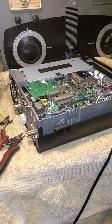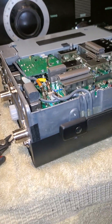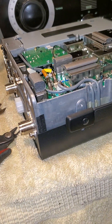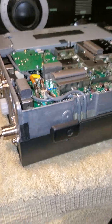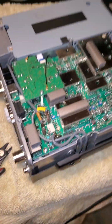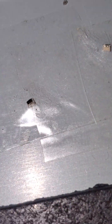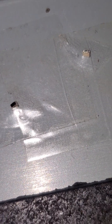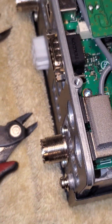I'm just going to make the abbreviated version of the 991A. The problem with this radio is that if you transmit near it with another radio, you'll blow out this resistor and the attenuator circuit in the front end of the radio. Right over here are the pieces of the surface mount resistor that explodes. And this same problem happens to the 991 also.